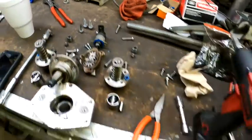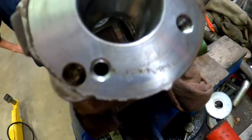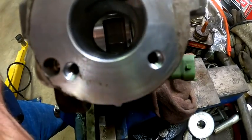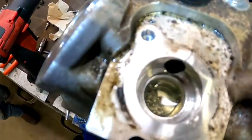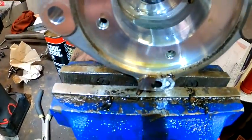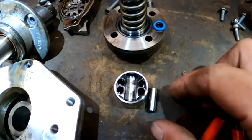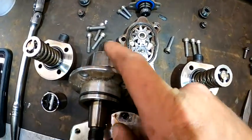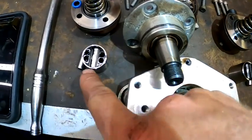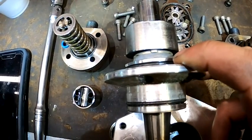There's a better look at your fuel pressure regulator and there's the port for the fuel pressure regulator. Now you should be able to see all the metal shavings that are down in there. Those are basically your cylinders — and there we go, cylinders. There's another shot down there with the light on it. These rollers are supposed to be nice and clean because these ride on the cam — they should all be nice and shiny, clean machined surface. That's where all the metal came from and went through the fuel system.